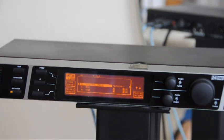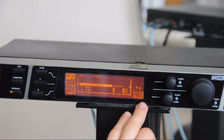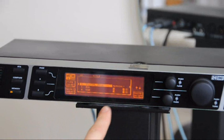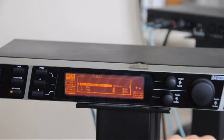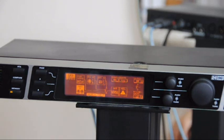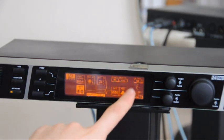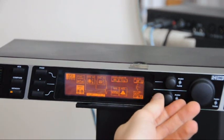Now we need to go to the Input/Output menu. There's a square pad just off to the right-hand side which I haven't been able to get in the video because I wanted to zoom in on the screen. The I/O button is on the square pad to the right-hand side, on the bottom row in the middle labelled I/O. Press that and the screen changes. You then need to set the noise gain to around about minus 10 or minus 12.